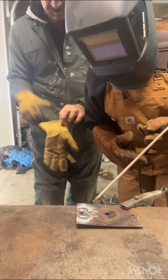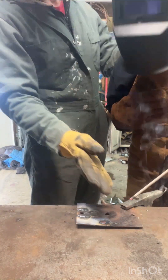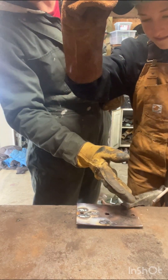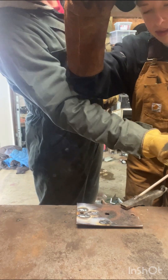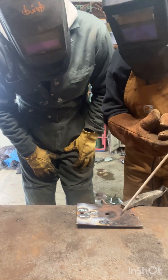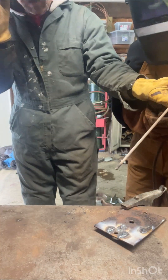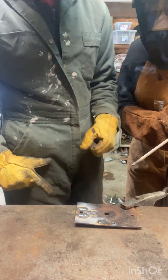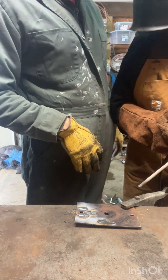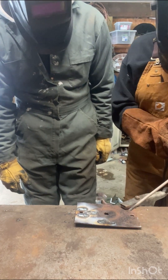Okay, go ahead. You don't want to put it way too far away. Remember, this is burning away as you're doing it, so you've got to be pushing it back into it. And your angle is a little bit too much — you want your angle to be more like a 45. You've got to start scratching. That's called your rod sticking — it'll burn up your welder if you let it keep going. So you've got to break it loose real quick. Scratch it first.